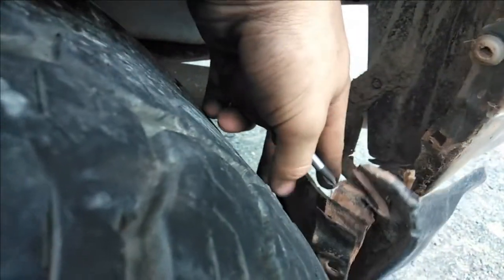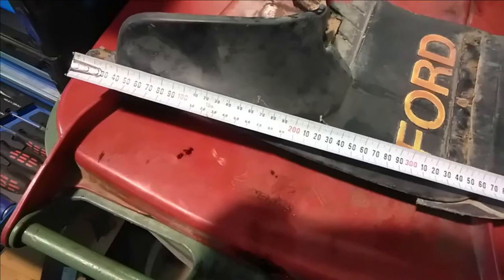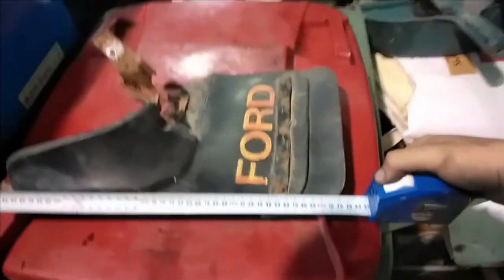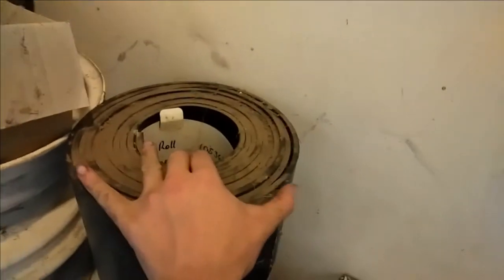To get our size I'm basically just going to measure from where it was last, which is basically the right size I want. From end to end it's about 430mm, so I think we'll cut at 440. And that will do us - the width is about 235 so I'm going to go 250 on these ones, and that will cover the length.